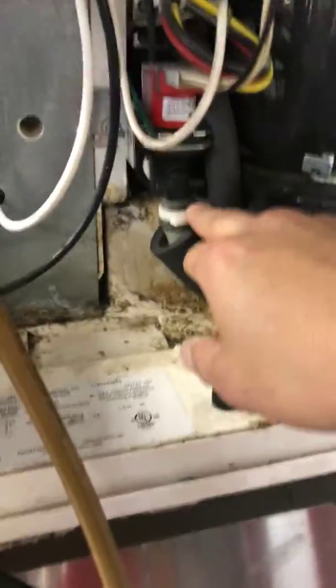It's going to take about 15 minutes, so I'll go through some parts with you. We already spoke about the water inlet solenoid, which is back here. The sequence goes into dump — it goes through the dump valve, takes the water out of the pan — and then once it does that it disperses water back in until we get to the proper level, which is sensed by the water level probe.